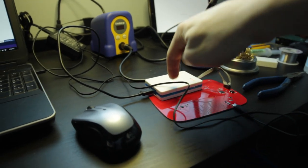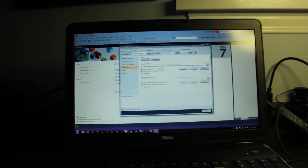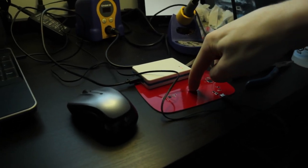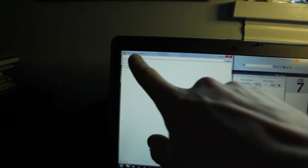Got the Atmel ICE hooked up to the debug port. That seemed to work. Now we can connect this directly to the computer — we don't need the programmer anymore. Since we don't have any LEDs or any way of indicating it's working right now, we'll just run the standard hello world program and see if it responds. And we have it — it's working! Time to put on all those LEDs, can't wait, let's do it.